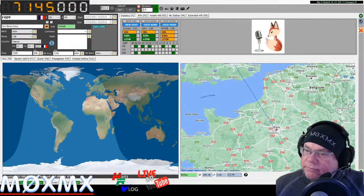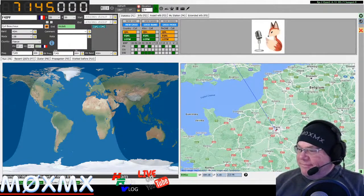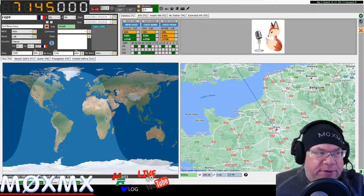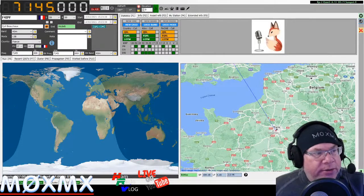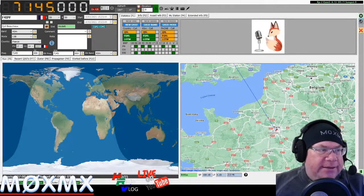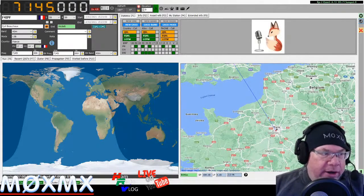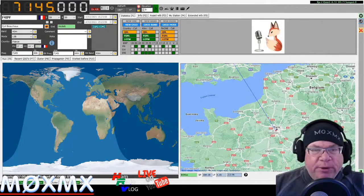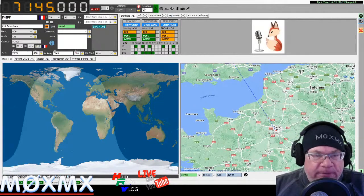Here my setup is ICOM 7300. I'll answer your question now, Paul. 12 meters above ground, QSL. Roger, roger, roger. I am using a Flex radio, an SDR, Flex 6300. And I am using a loaded dipole, which is a wire dipole 20 meters long, which has loading coils for 80 meters also. So it covers 40 and 80 meters, only around 7 meters above the ground. And I am using 100 watts only out of the Flex radio, QSL.